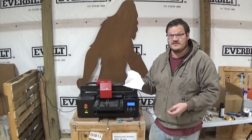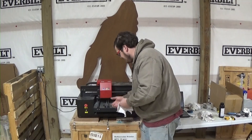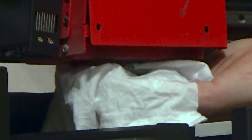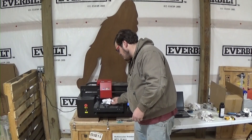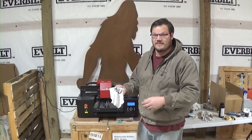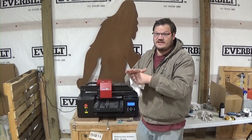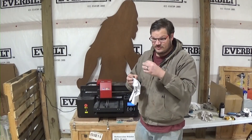I'm going to wipe the bottom of the print head just because it's been sitting so long. I suggest using a microfiber cloth for this. Move the table out of the way — down on the bottom here you can see the print head. We'll just wipe front to back. Make sure there's no gunk buildup on the bottom of the print head. If we had buildup there, there could be a dry clump of ink keeping the gasket from making a seal, and then it won't be able to load the ink — it'd be like sucking out of a straw with a hole in it.